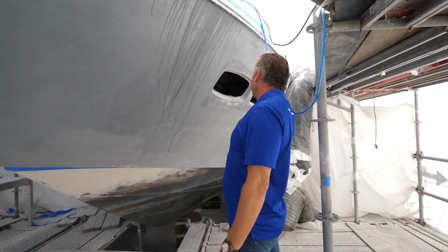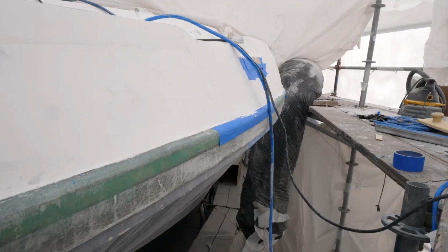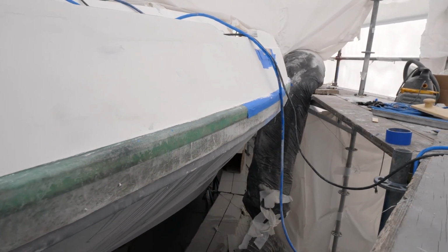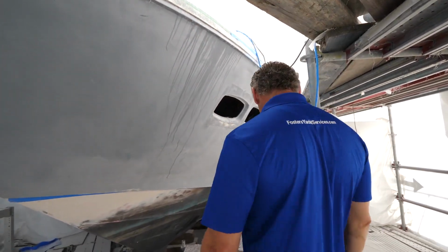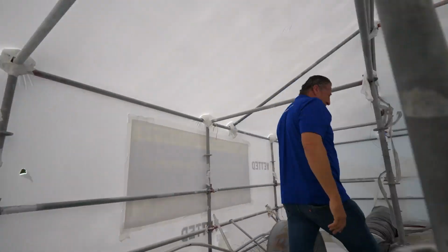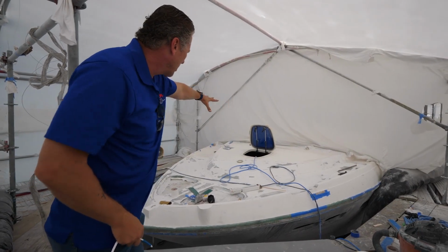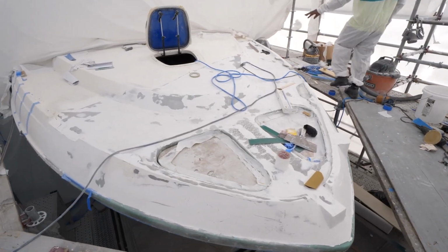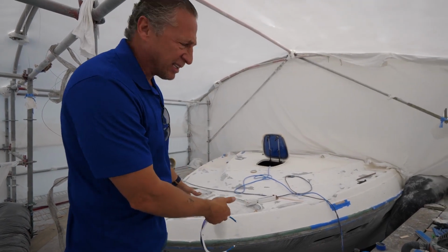We took that hull from there, cut the whole boat off, and all of this has been replaced new. And you can see right now we're doing our final glass work and laminations up here. And follow me up here, I'll show you the new deck we just put on. See what we got here. This is our brand new deck that came from all the way over there. We replaced this whole thing with a jig mold wood. We did our glass work, pulled the mold from the inside.